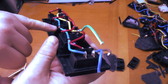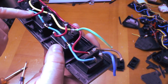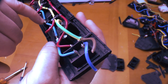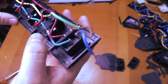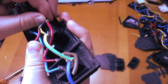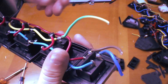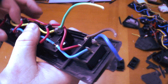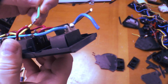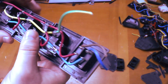This has got equipment wire actually going through the terminal, so it's still soldered again, but it's been threaded into the gap and then filled with solder, so it's a lot more secure, hopefully. And those seem to hold okay onto the, oh dear, spoke too soon. Earth wire just broken off there. Looks like it could be a dry joint, or it's probably just that awful lead-free solder stuff. The rest are holding in.